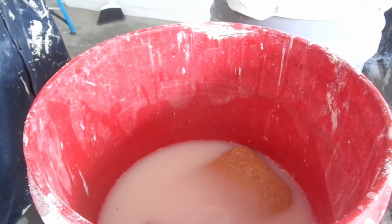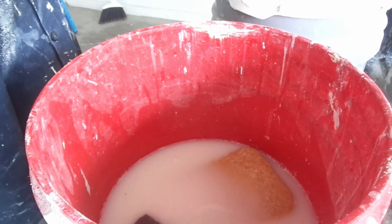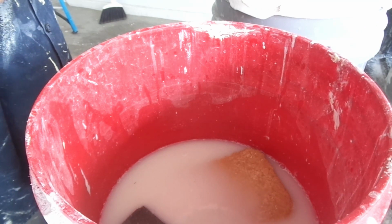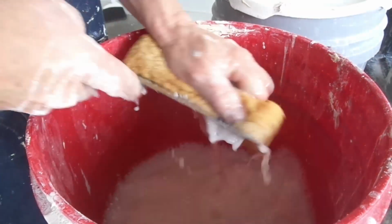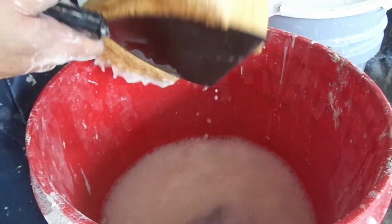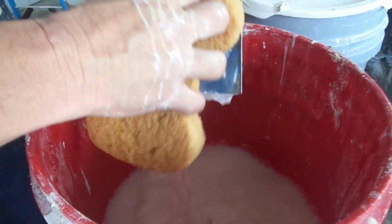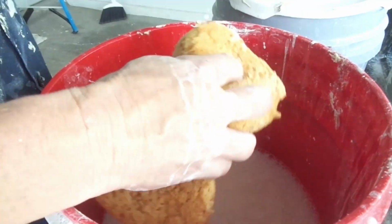Your knives, if mud gets caked on there, just use your six to scrape your coating knives. Vice versa, use your coating knives to scrape your six. Get that mud off there. You got all the bulk mud off there, go ahead and wipe everything down. Nice clean 6-inch knife. Keep these knives clean. These knives, if they stay clean, will last a long time. The only time you replace knives is if they get bent or if they break from rusting out. A nice clean knife will last a long time.